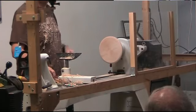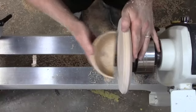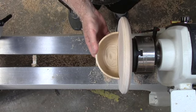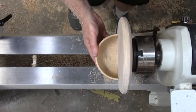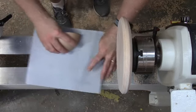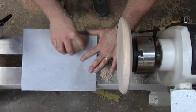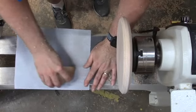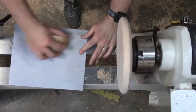Now I've got my spot here and I have to get my half bowl and decide how I'm going to mount it, where I'm going to mount it. My half bowl is not perfectly cut straight either. I'm pretty happy with the backer board but that bowl is not straight — it's still wobbling. I don't have a hand plane like Mel, so I get on my big piece of sandpaper and sand the back side of the bowl flat. This is 80 grit, in case any of y'all have never used grit that high — or that low.